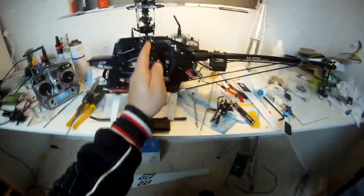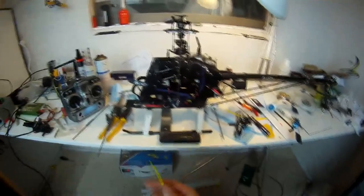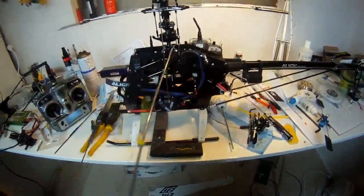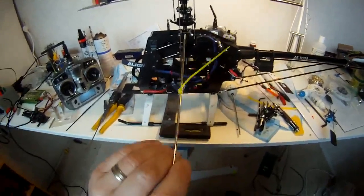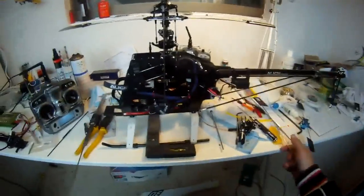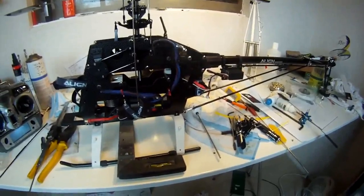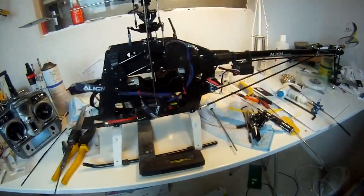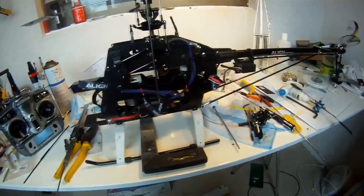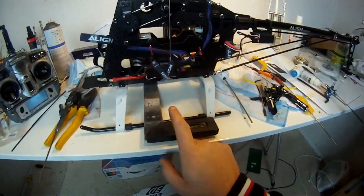We'll set this height again, then move from right to left. We're going to be looking right in here against this shaft face and then right down here against this shaft face, comparing the inside of this to the inside of this — seeing whether they line up at exactly the same point as we move across. If they don't, this needs adjusting one way or the other. Let's have a look — move slowly from right to left. That's actually out — if you look at the bottom, it's actually out about two millimeters.